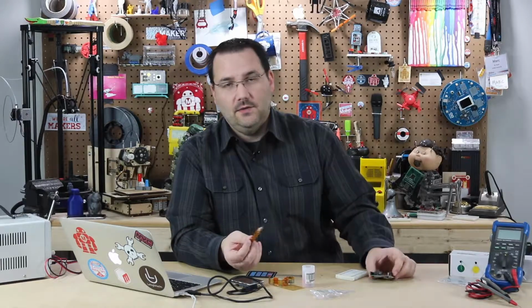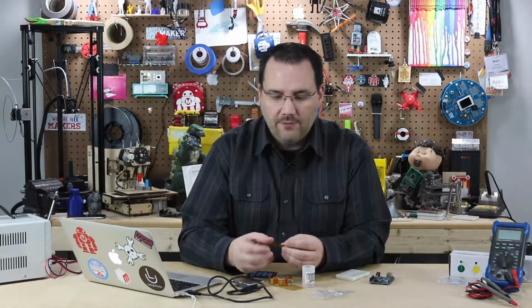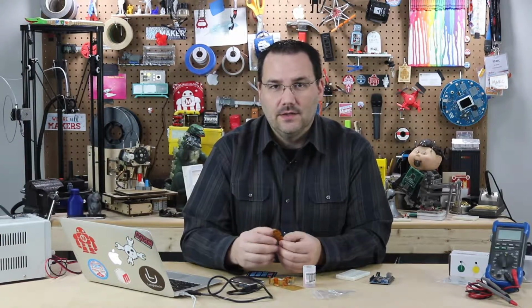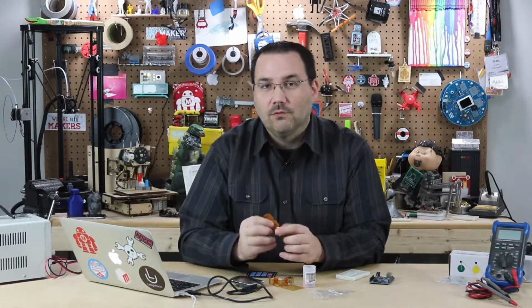Another thing that they can do, which I think is really cool, is what's called overmolding on the circuit board. So after you manufacture this, they can actually put this in a plastic injection molding machine and inject rubber over it or plastic over it. So you can think about if I were to build something like a Fitbit, this could actually go inside the mold. They inject the rubber, and now it's really waterproof and secure. Downside is it's also not really accessible anymore.